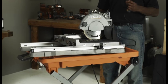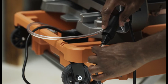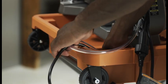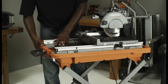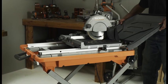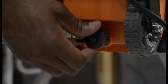Connect the pump power cord to the motor head power cord. Check that the rubber boot is pulled over the cord connection to help keep water off the plug. Where applicable, rest the power cord and water hose in the notches provided on the water tray. Install the saw frame to the water tray and water tray extension as required. When using the R4040S and R4030, install the drain plug and fill the water reservoir with clean tap water to the fill line. Do not fill past the maximum line.